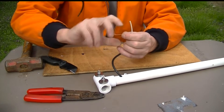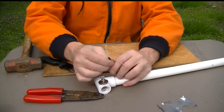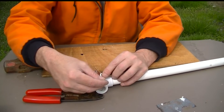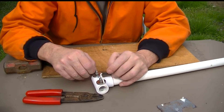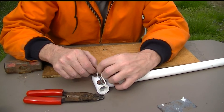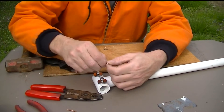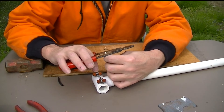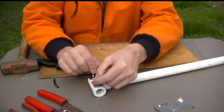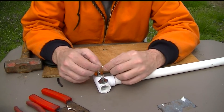Twist them up nice and tight. I've already got the soldering iron warming up. The bottom one — the T — has got the bottom sticking out. That's the negative or the braid. I want to make sure we leave enough account for the rings, then snip these little buggers off. If we make a mistake we can always come back and do a little more, but let's try and do it the right amount just right the first time.